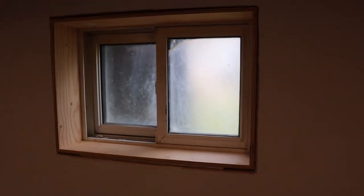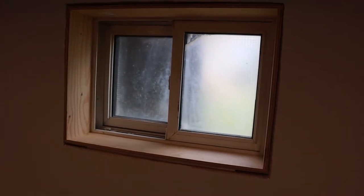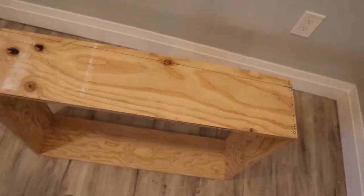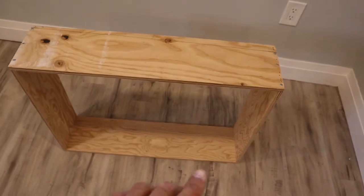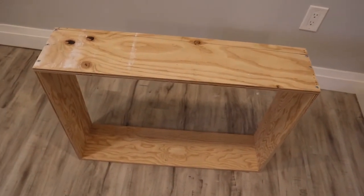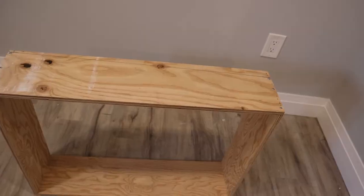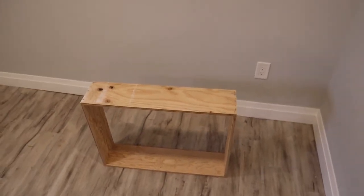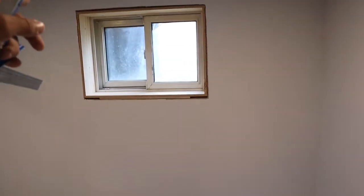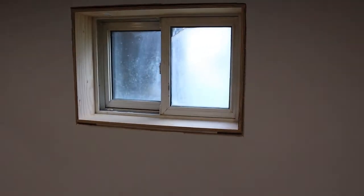What I've done is I've actually gone and pre-made these window boxes, and these here, they are square. I cut the top and bottom and left and right at the same time, so I know 100% sure that they are going to go together and have nice, tight, and square corners. Now what I'm going to have to do is fit this window box to a window frame that is asymmetrical.